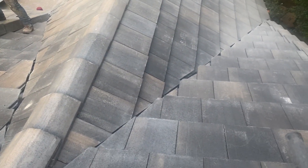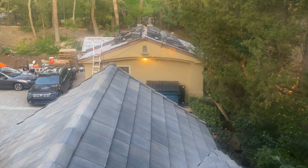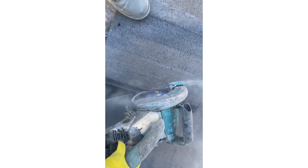Here we are — we installed it. It's a flat tile, a plan tile. He bought all the materials and I'm charging for the labor. I used wood battens on the steep sides, like this little dormer. On the walkable areas of the roof I didn't put anything, just nailed straight to the deck. On the steep areas I put wood battens so I can hang the tiles and put an extra nail in them. For my valley, I did a close-cut valley — I fold the edge of the valley to elevate the tile about half an inch from the roof, and I cut each individual tile as I go.